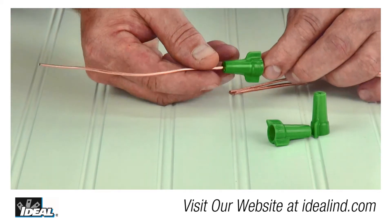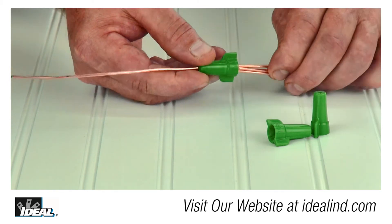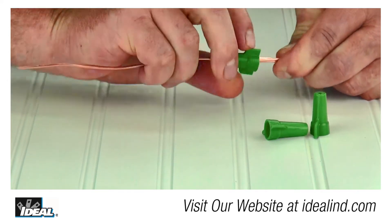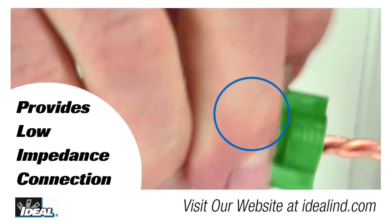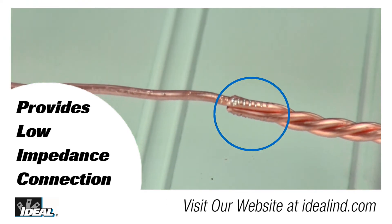With the Greeny, we can reduce one of those conductors by passing one of the ground conductors all the way through the end of the connector to create the grounding pigtail for the device. All of the other ground conductors can then be bonded together using the wire connector. The range of the wire connector is from two number 14 gauge to four number 12 gauge solid conductor wire combinations, and the square wire live action spring provides a superior low impedance ground connection.